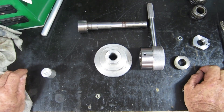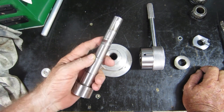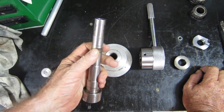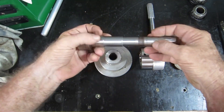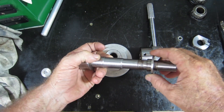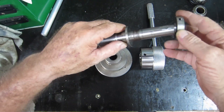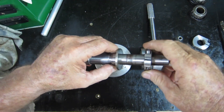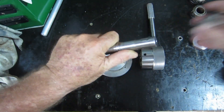So I've knocked the spindle out of the milling head and noticed a couple of things. Looks like the top bearing has been turning on the shaft here - it's worn it just a little bit. That makes me think I didn't have enough pressure on the top. This slides down over here, pushes on the bearing, and the old ring just sat over there and clamped on to push it down. So it may not have been hitting correctly - hitting on the top has pushed it up this way.